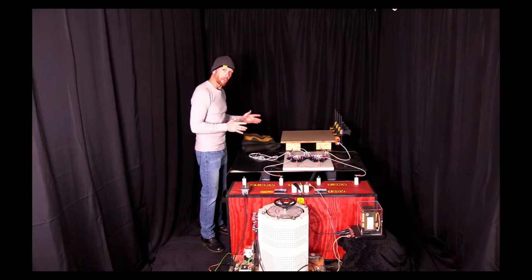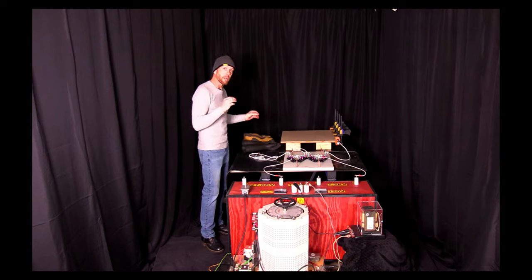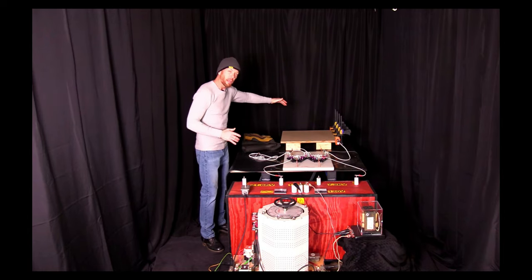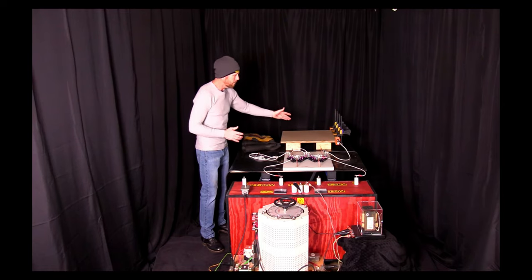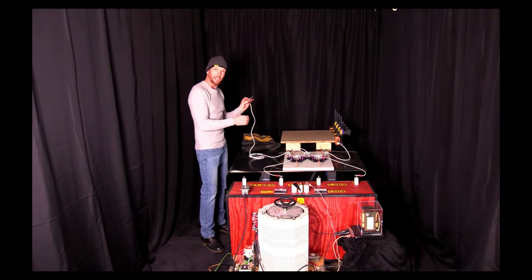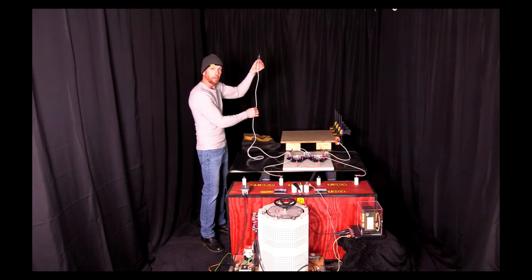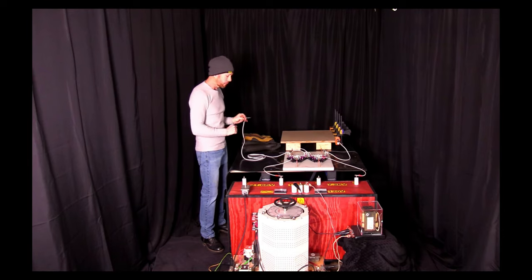And the specimen used for the fractal itself? Well, that'll be a 2 by 2 foot piece of 3/4 inch medium density fiberboard. Now my plan is to clamp a metal bar across the entire top edge of the MDF. That bar will then be electrically bonded to the cathode of the rectifier. A pointed metal spike will then be connected to the anode of the rectifier by way of a thin insulated wire, and this spike then manipulated by hand to encourage the desired tree-like geometry.